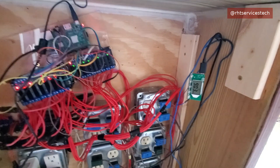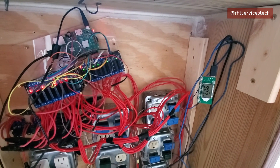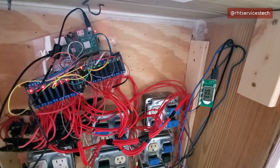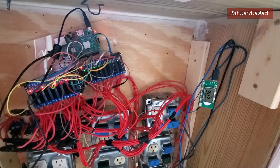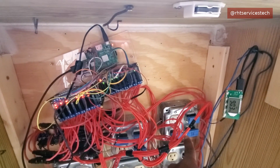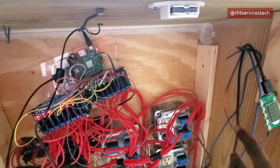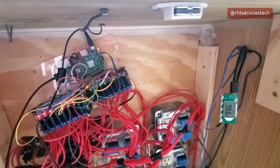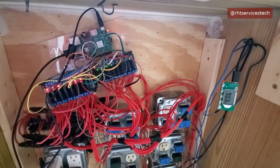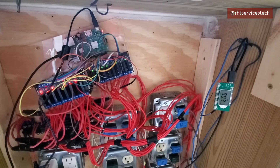I used this setup last year in my light show with the USB and it worked great, so I continued to use it again this year. I did notice some interference, and I think that's because of the proximity of the control wires next to the antenna, which is this blue wire here. Trying to get that more distant should stop it — it's minor. You can still hear the audio perfectly fine; it may just have a little bit of white noise when that particular channel turns on.